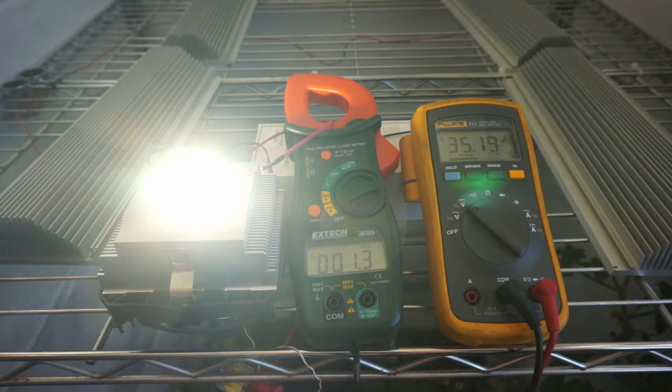It looked like it was working a bit harder than it should be, and you may be okay if you're maybe a handful of volts below what the minimum is. You know, if you're 5 volts under or something, that would probably be okay, but being at half of what the minimum is, I think would cause problems long term. I'm not sure how long it would take, but nonetheless it's not exactly working as it should.